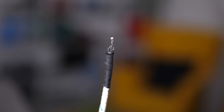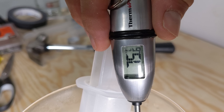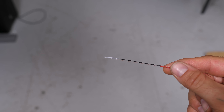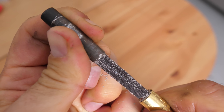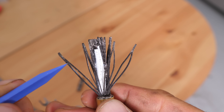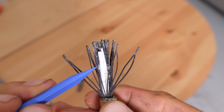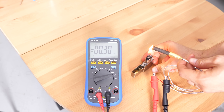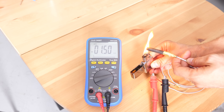When you have two dissimilar metals joined together like this, it's called a thermocouple. A thermocouple is the working principle behind a lot of thermometers, especially those probe thermometers you put in food while cooking. If you look inside the tip of one of those probe thermometers, you'll find two dissimilar metals joined together. The voltage from a thermocouple is really small, so if you want a decent voltage you need to put a load of thermocouples in series — that's what's going on inside here, with loads of wires going up and down joined all in series, with a whole load of hot junctions and a whole load of cooler junctions. This is called a thermopile, and the voltage you can get from it is much greater.